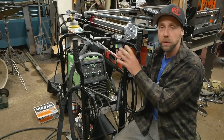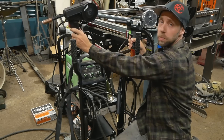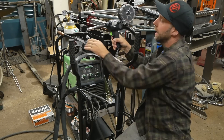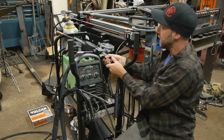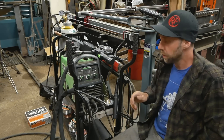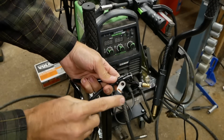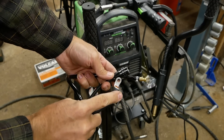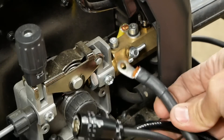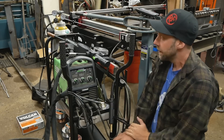This applies to the Titanium 200, 170, and I believe the 140. I got two spool guns here. This one is my own — it's a Clutch spool gun. This is the Harbor Freight, and actually the Harbor Freight sells for less and feels like maybe a little bit better build quality. But the Clutch has a cool feature — it has the same contacts and gas line hookups, but it has a lug lead right here. You can hook on inside the lug on the MIG with the little wing nut and never have to remove your MIG lead or your wire.